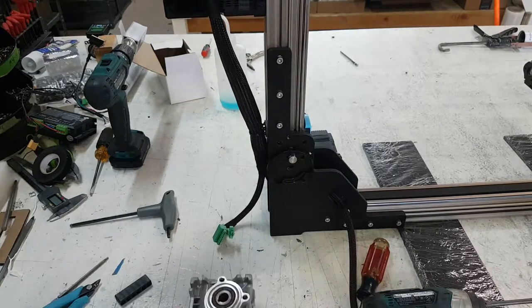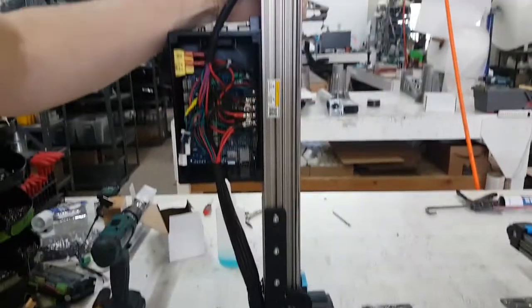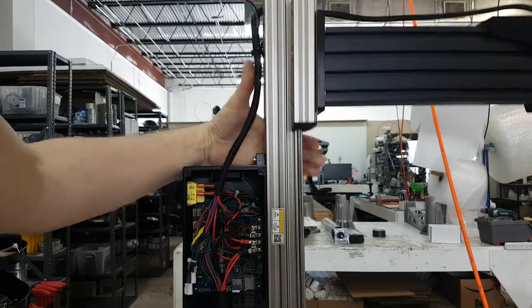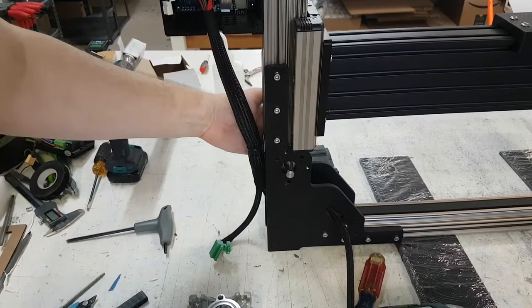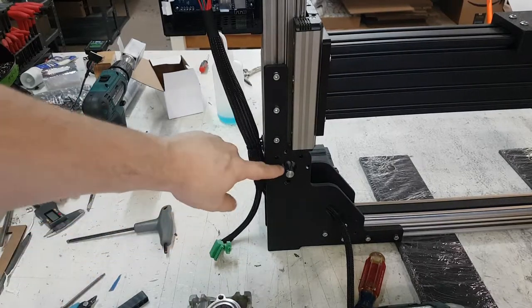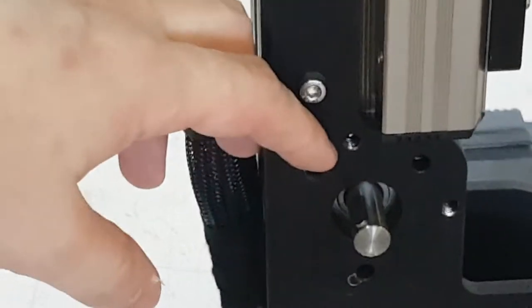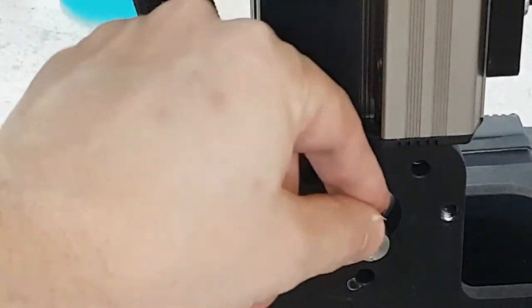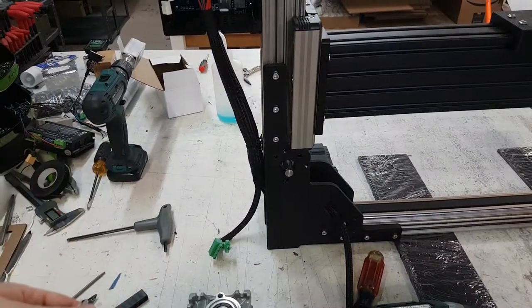As you can see, now it comes off. But when it's in this position, this is loose. I am currently holding the belt with my hand here to prevent this from crashing down — it will come crashing down quite quickly. We also want to make sure that this keyway — this motor shaft key right here — is still there. If it pops off and falls down, you must retain this little shaft key. We do not want to lose that.